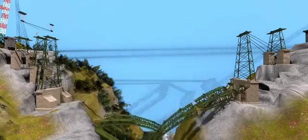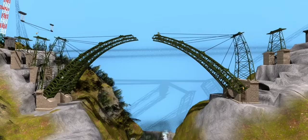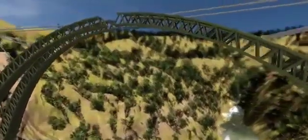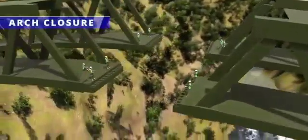More interestingly, to balance the force on the first main pier, the cable stays were connected to the neighboring pier in the opposite direction. Without these stay cables, the main piers would bend inward. Then came the crucial day — the completion of the arch erection. Both halves of the arches met on this day, a process known as arch closure.